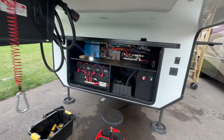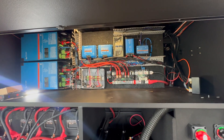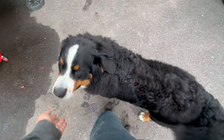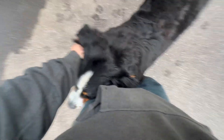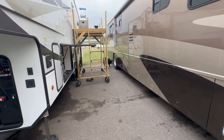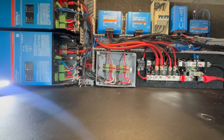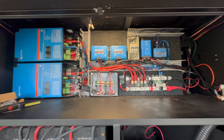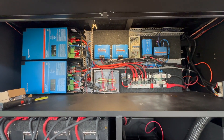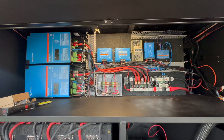We're closing in on the day and getting ready to do a FLIR thermal imaging test on all this. I've got a space heater running inside, so now both of the multi-pluses are working. Let's take a look at how much power it's using — 1.6 kilowatts on the space heater, pulling 64 amps. We get a little help from solar. We don't have a state of charge yet — the SOK battery monitors are showing about 30%, but I want that to sync naturally from charging. We'll probably plug into shore power this evening and it realistically won't be full until morning.